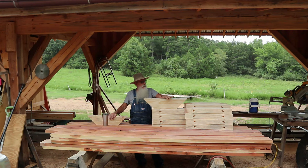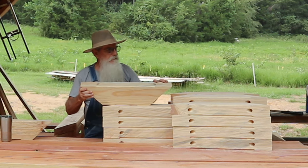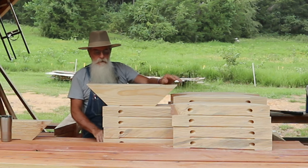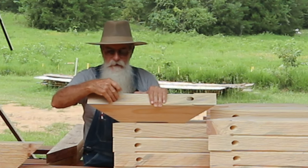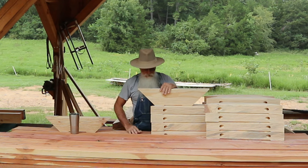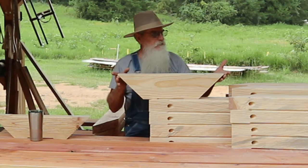I've been working out the small knee braces that'll go up against the top plate and against the tie beams. These are three by six. I've already got the holes drilled for the anchors, which I'll probably use a three-eighths lag bolt. And then I'll fill these holes with a peg — I'll let it stand a little bit proud. I could just completely peg the whole thing, but I don't really have any drawing power with just a peg. With a lag bolt, I can actually tighten this up and hope to get a nice fit on these 45-degree angles.